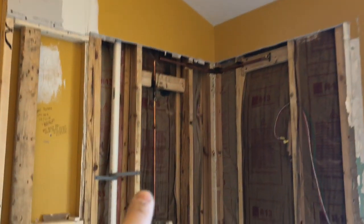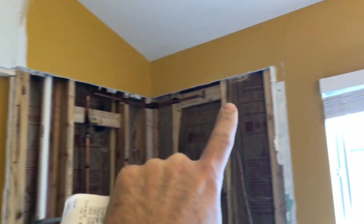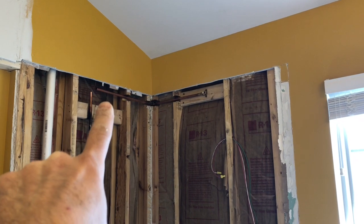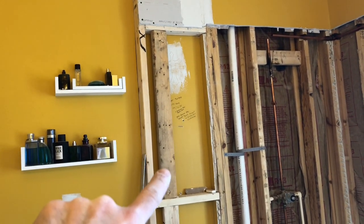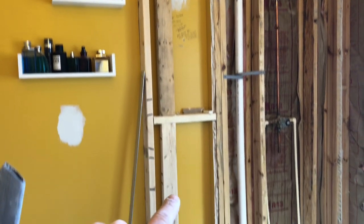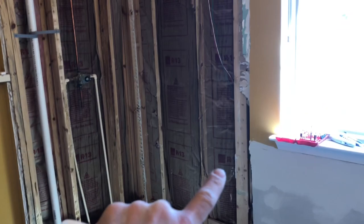Removing the shower head from this area to that area, got most of it done and just need one more elbow. Got the wall extended. Also, don't forget to put in support beams if you're doing it yourself — for where your shower glass door is going to be screwed into the wall. That's what those two bars are right there. Got my PVC pipes and installed the three-piece drain flange in place.